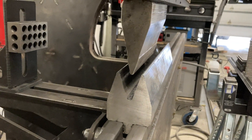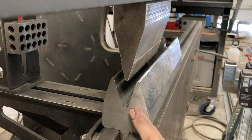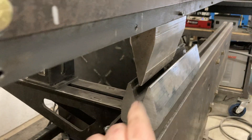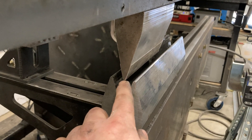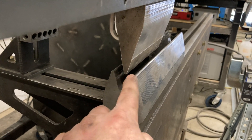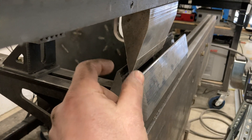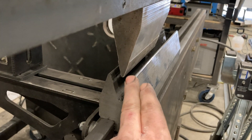I bought eight feet of this acute die. I had a project where I needed to bend quite a ways past 90 degrees, and this width was set up for basically 10 gauge. A bummer about having a press brake is that in reality you should have a top and bottom die for every material thickness. The radius of the punch should match the material thickness, and the width of the V die is supposed to be eight times the material thickness — so for quarter inch you need a two-inch wide die, for eighth inch you need a one-inch wide die. That trend continues until you get to pretty thick material, and then the rule of thumb goes to about ten times material thickness for the V die.